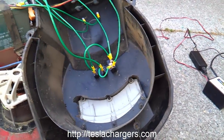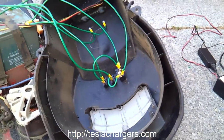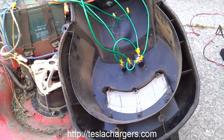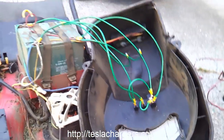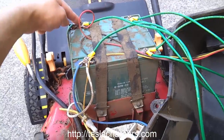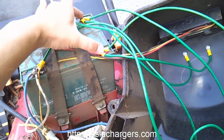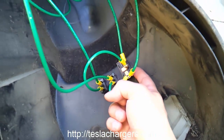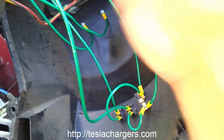This will be a little bit quicker, a stronger charge, plus when I have a 12 volt setup here, I'll be able to put the solar charge controller on there and charge it in the sun and be a lot more flexible. So normally the batteries are 12 volt and the factory wire jumps them in series for 24 volts. What I did was I took that wire off and I've got three switches here, which you can see right here. The purpose of these switches is that this big switch will disconnect the series connection so that the batteries are isolated from each other.